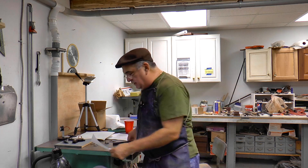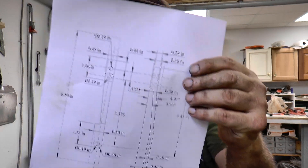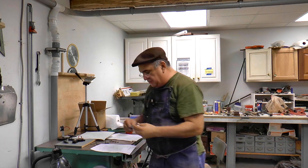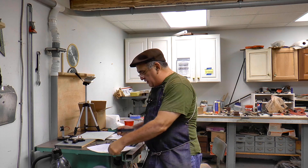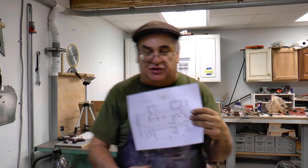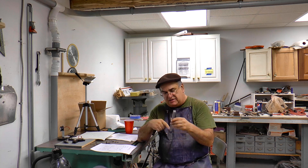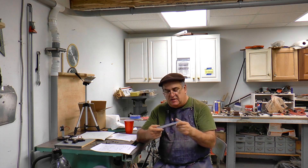How I'm going to do it — I've got extensions on either end so I can hold it. If you look back at the drawing again, you'll see the dotted lines right up in here and at the bottom — that's extra stock I'm going to use to hold it while you're milling it, because there are angles and everything. While it's flat like this, I'm going to drill and ream the three holes for the combination lever: the one where the radius rod goes, the crosshead guide, and then where the union link goes down here. I'll drill and ream those holes — three sixteenths, all three of them — and then work from there, because that's the most important thing, that they be where they need to be, and then the rest of it is just shaping.